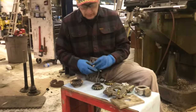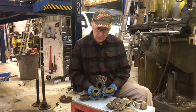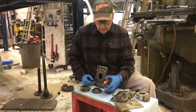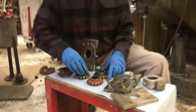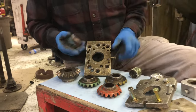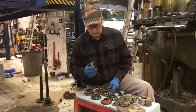Amazingly, Ford 28 spline, Ford 31 spline, and Dana 44 30 spline — they're all the same size. So with two sizes and a little spacer bushing, I can do a lot of different sizes. And if you come up with something you don't have, you just make another bushing to match.